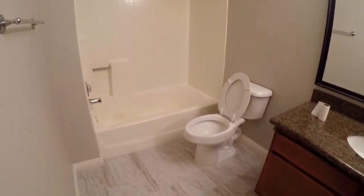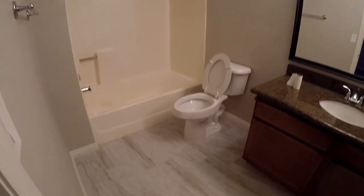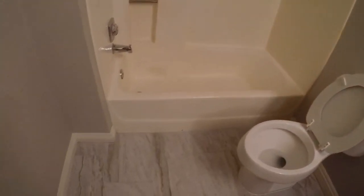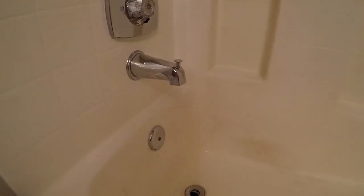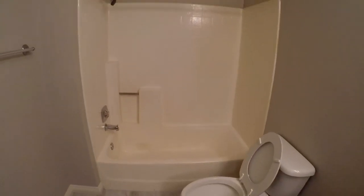Here's the second one - same thing. From a distance you can see it's a little bit yellow. With the color tone, you've got gray on gray - you want it to be white and really pop. Same thing here, looks like it's been slightly coated before, just got soap scum and worn spots. Maybe they cleaned too hard and went through the coating, and there's a bit of a leak. I'll glove that. Same process: I'm gonna sand it all down, wash it, rinse it, primer it, and then spray the bright white finish.